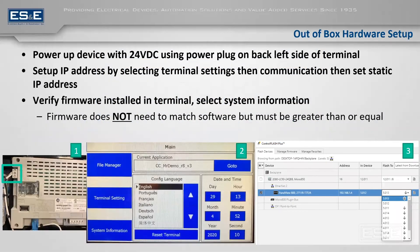Going over the details and hardware setup: all PanelView 800s are 24 volt DC, so you will need to power them up using the power supply plug located on the top left corner of the PanelView. You can see this in the image in the bottom left labeled number one. Apply power there.